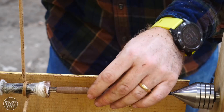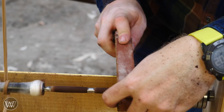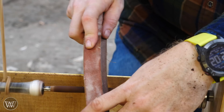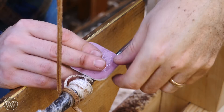Next thing is to move on to a bit of sanding and shape it all down. I use my bow sander for this and I can put in different grits to bring it up to a fairly nice working grit. The bow sander allows me to handle it fairly well without having to go and get strips of paper. I wet down the grain to try and raise it up and get rid of some of the fuzzies, then hit it again with the sandpaper very lightly — about 300 grit — to hit all the fuzz from the raised grain, especially on the black walnut. Then I use a set of micromesh to really bring this into a decent shine.